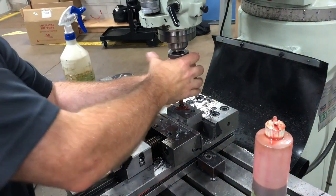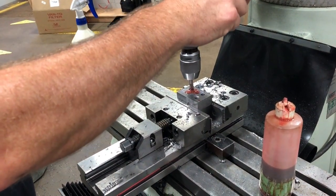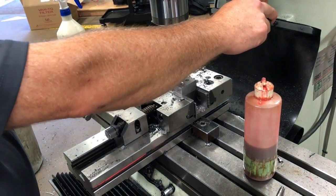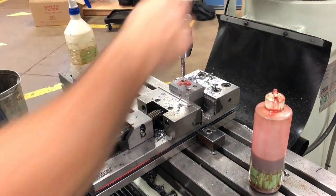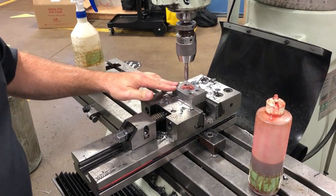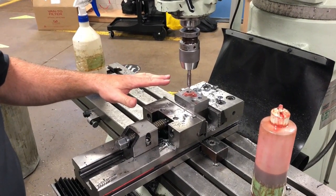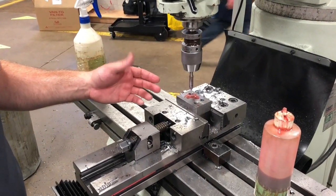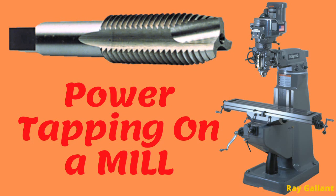Release this, put it back into gear, tighten it up. Now you don't want to slam forward into reverse. Keep in mind this is not tool steel — this is mild steel and that's a new tap, so I knew it would cut like a knife through butter. If it was an older tap or tool steel I would probably not bother and would hand tap it the rest of the way. But since the material is soft I'm relatively safe that it won't break. If you have any comments please leave them in the comments section below. Check out my YouTube channel Shop Math for other great videos.